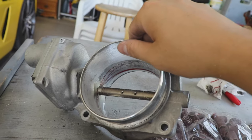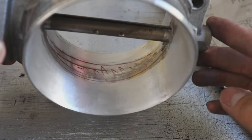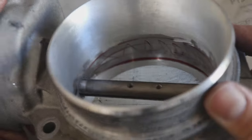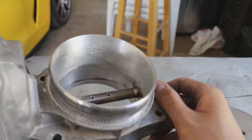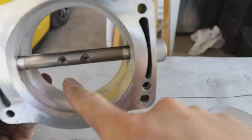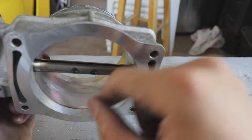You guys just missed about an hour of me trying to make this as perfect as possible. We got down all the way to 600 grit and it looks pretty good — you could honestly leave it like this because it's already very smooth to the touch. But I went ahead and started at 1,000, then moved on to 1,500 grit. After 1,500 it's like glass, honestly. Just watch out for little bits and pieces in the small holes and the slit up top — I used compressed air to clear those out.